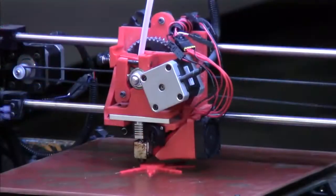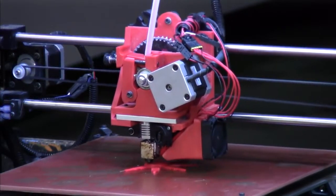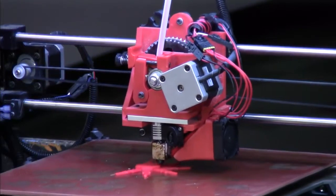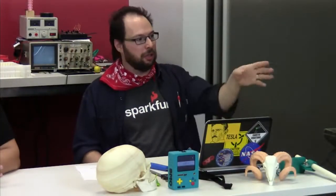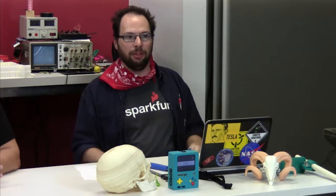Another problem that you can run into is mechanical jamming. This one's fairly rare, but if you have an object or a print even that prevents the X or Y axis from actually moving, that can ruin a print just as well, and that can also cause damage to the printer itself. I've really only had a problem with that once in 3 years of running this particular machine, and it was just a stray piece of cardboard that I was using to block drafts before I built the plywood walls, and it just became dislodged and prevented the X axis from moving. I was a little upset with it because it was a larger print, but I learned from it and I was able to mitigate it in the future, which is now the past.